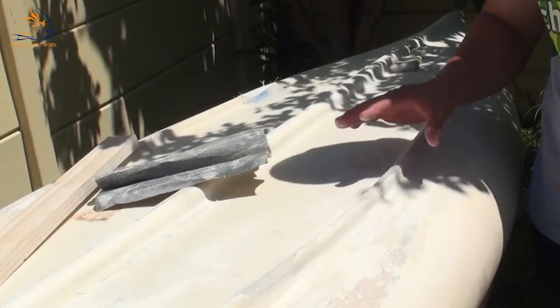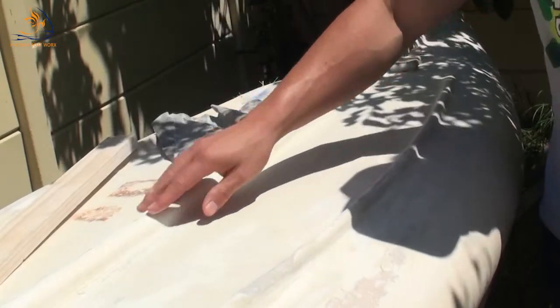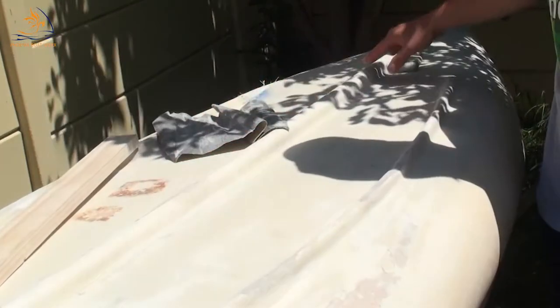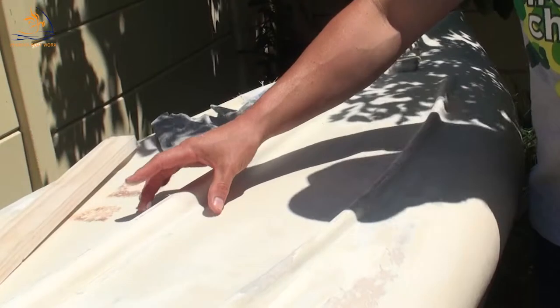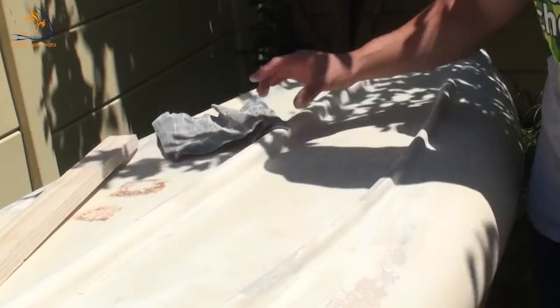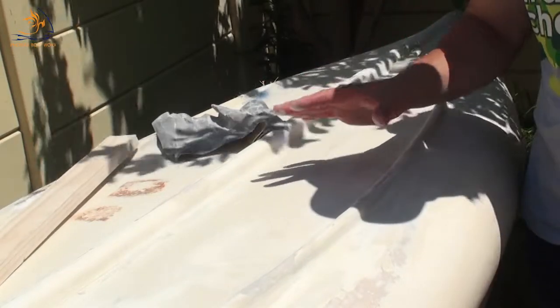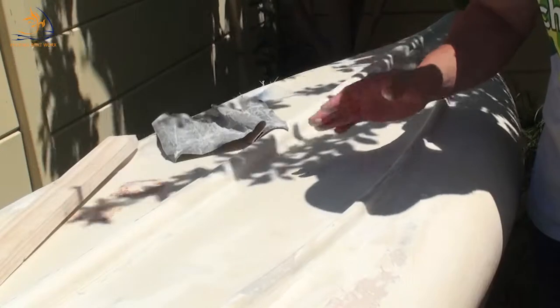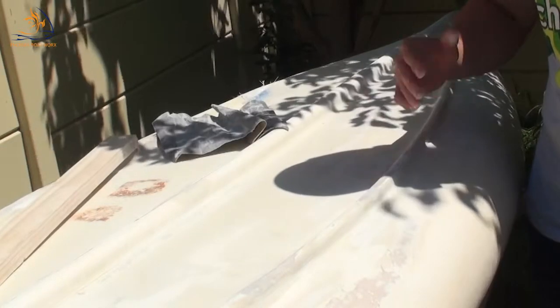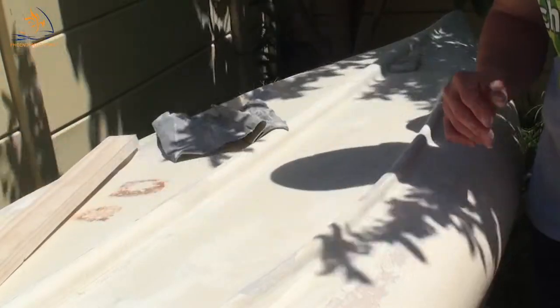What we are going to do then, after we've done that, is strengthen the stem of the boat along here with a little bit of fiberglass we can just put up over here. I think it's 2 ounces I'm going to use. That will strengthen it up again, and then we're going to sand the boat down to 120-180 grit, and then we are going to paint the boat.